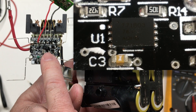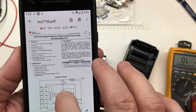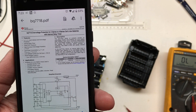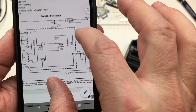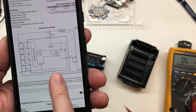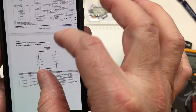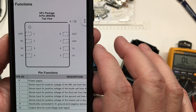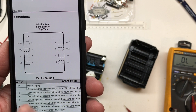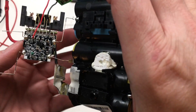We do have an 8-pin chip right here — the 7718 chip. Looking at the Texas Instruments version, it's a two-to-five series cell battery overvoltage protection circuit. We'll have our cells connected to the sensing circuit, and then there's only one output — so there's not much to this chip really. It has a lot of specs on the shutdown functionality. The pin labeled DPJ package has voltage sensing and cell sensing all the way through five cells it can monitor, and pin eight is the output.